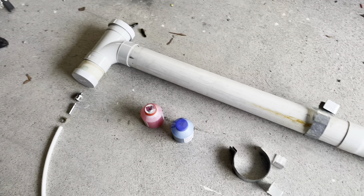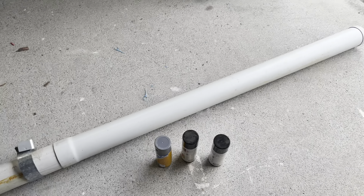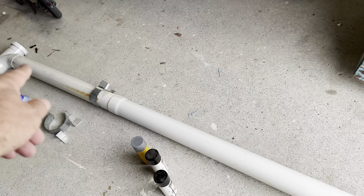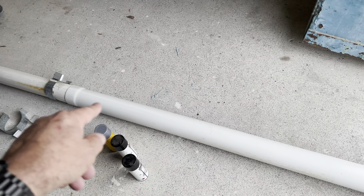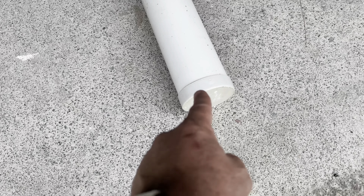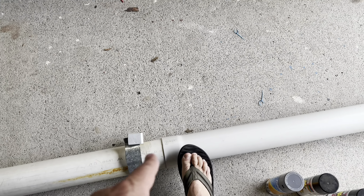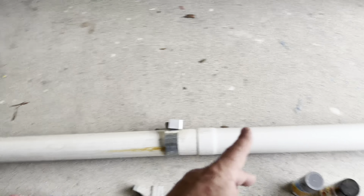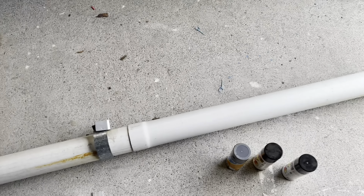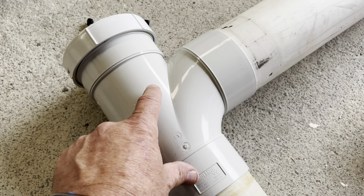So these are the components I'm using to make this pressurized water tank. This is safe to pressurize up to 30 PSI. You need your pipe - obviously it's 100mm sewer pipe. I've got an end cap, and I've got two pieces of pipe. I'm going to join them in the middle to make one length. I'm just using what I have at home mostly. What I need, I buy. I had to buy this piece here at the end.